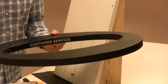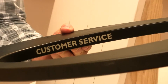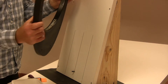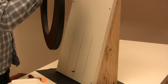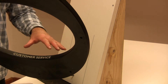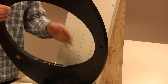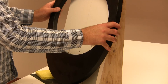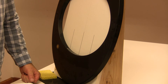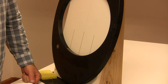And you can see the application has been made — that's all there is to it. It's a simple way to decorate your part, especially going on that inside radius, which would be very challenging to do with screen printing or labeling. You can then take some 409 and wipe off the part; that will help remove any water marks that may stain the powder coat. So 409 it and the application will be complete. If you have any questions, please don't hesitate to call. You can contact Russ Dixon at 815-363-7030. Thanks, we look forward to your feedback.